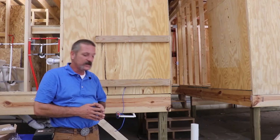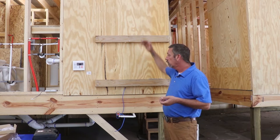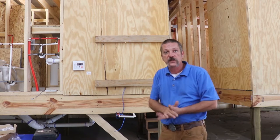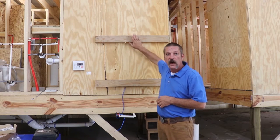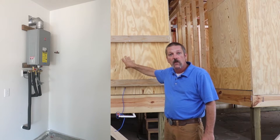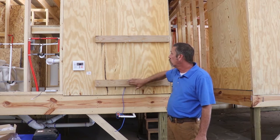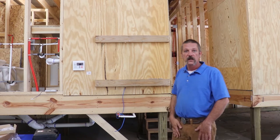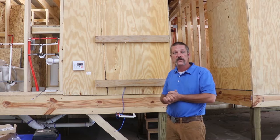The next thing you want to do is prep your work site where you're going to be hanging this water heater. When dealing with an external unit mounted to brick, you'll want a hammer drill and impact driver. If you're on an interior wall with sheetrock, there are studs every 16 inches on center behind it. You'll need to cut some boards, nail them across that span, and hang your water heater to those boards attached to the studs. Measure your water heater from top to bottom to get your board placement right.